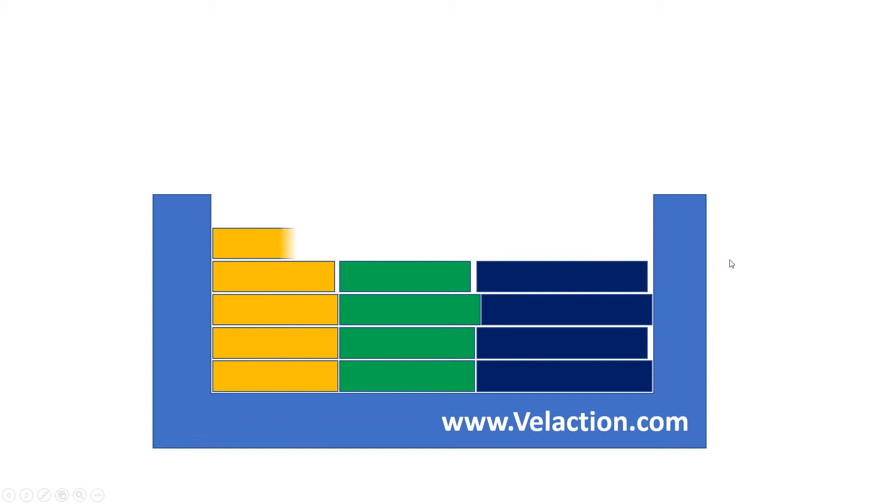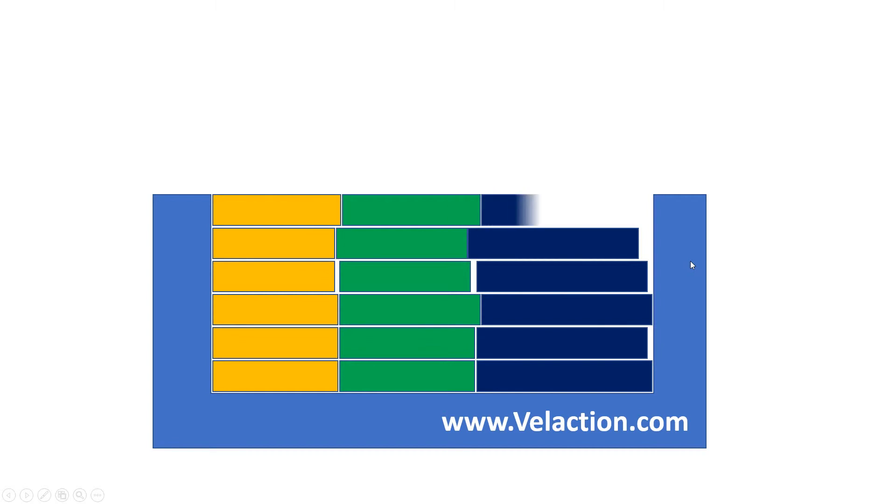So this is tolerance stack-up. When you talk about tolerance stack-up, what they're saying is you put all these parts together — all four of these parts are all within spec. And that's the key: each individual part is within their specification limit. But because they're all towards the same end, it all contributes to a cumulative effect and you end up with a big gap that becomes unacceptable. This can work in both directions — you can have it going in the direction where it's too small and leaves a big gap, or the three parts just don't fit in at all. Even though everything is in spec, you end up with problems where the system doesn't work, even though the individual components are all okay.